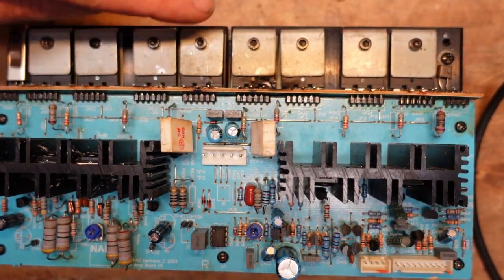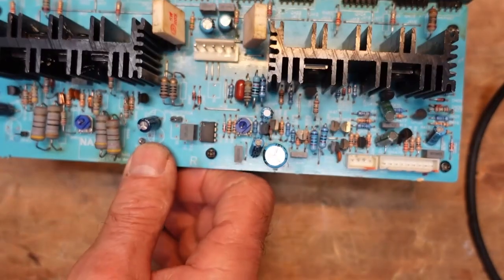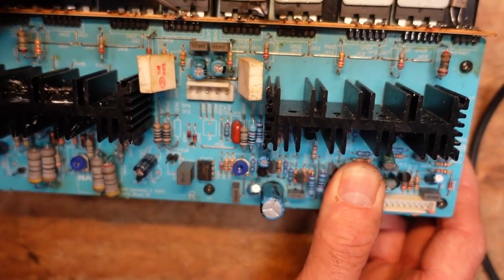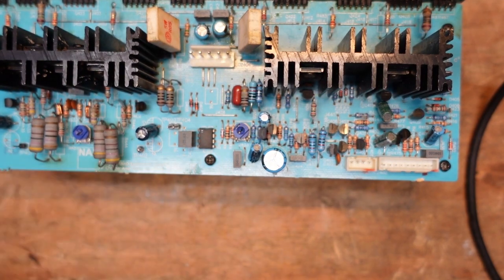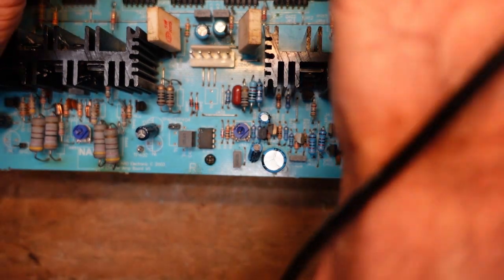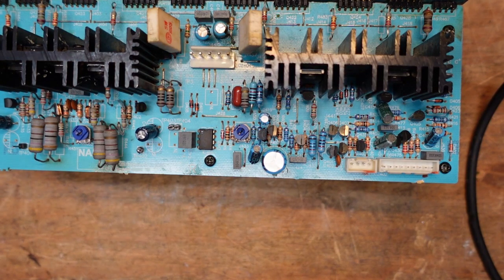I don't know if you can see this, but we've got a pretty badly looking burn mark right here. That really shows up on the printed circuit board. So yeah, this transistor is definitely bad, and this one appears to have a mark that would indicate it might have problems as well. This area here and here look like they might be in trouble. So what we're going to do is start lifting the leads of these transistors — we know this one's just done. If I put my meter here in diode mode and we test it, you can hear that's a dead short. That transistor is completely dead shorted. So I'm going to start lifting the leads of these and see exactly what we've got.